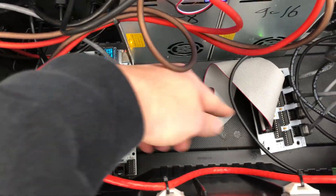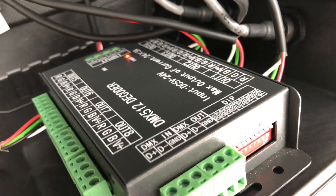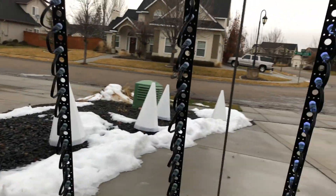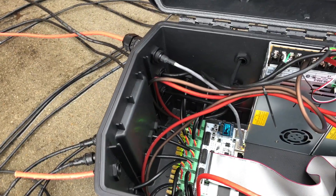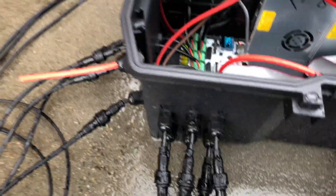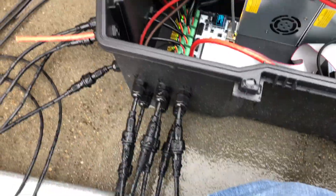This runs from the Falcon into the remote board. Also on the Falcon we have one cable run over to a DMX — this is the dumb RGB controller. Those go to the 4-pin weatherproof connectors that go to the trees along the side. This is the input into the Falcon from the laptop in the garage. We have 16 3-pin connectors running around the perimeter of the box — these are all for the independent strands on the mega tree.